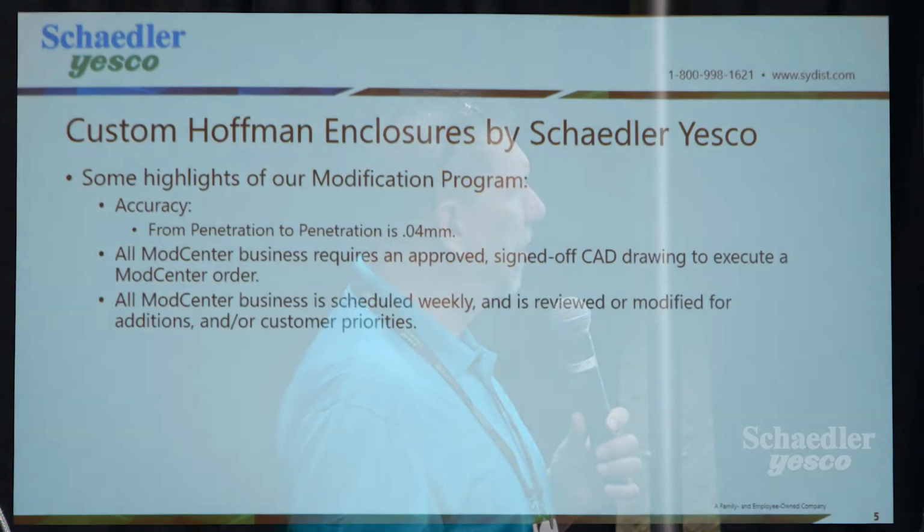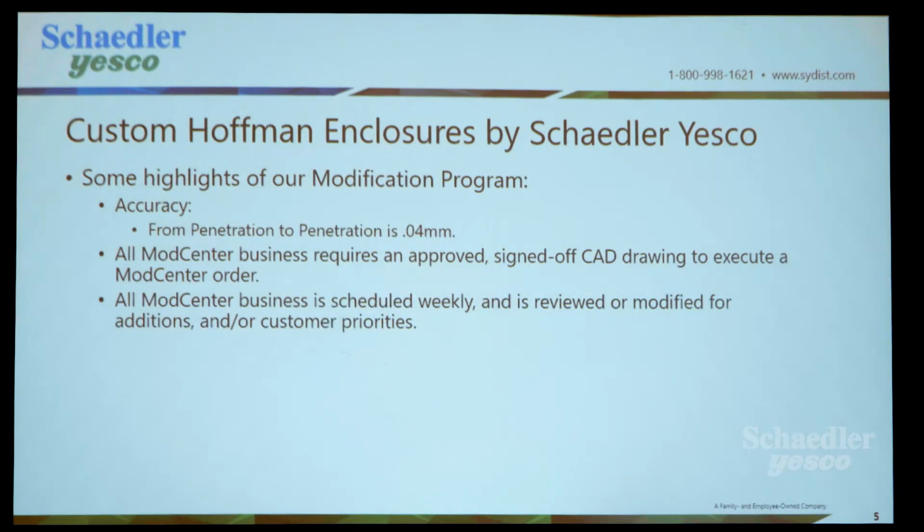Once we get an order, we'll make sure that we have the final signed, approved, dated drawing, so we make sure we have the right rev. Because we have repeat customers who may have us cut the same enclosure, but they have 6 different drawings for it. It's just the same, but there's this extra little hole or this extra little operator, a little widget. So we need to make sure we have the drawing. And actually, we file it under the customer as enclosure, the drawing, and even the rev because it can change. Right?